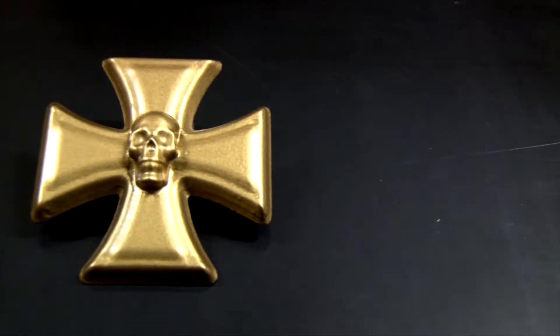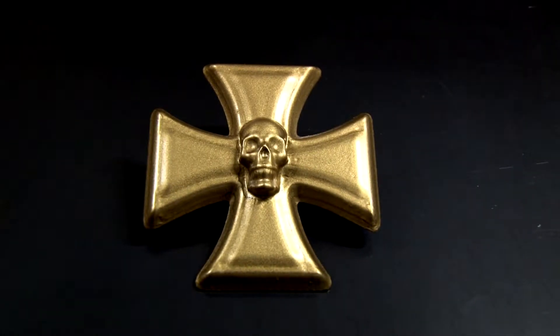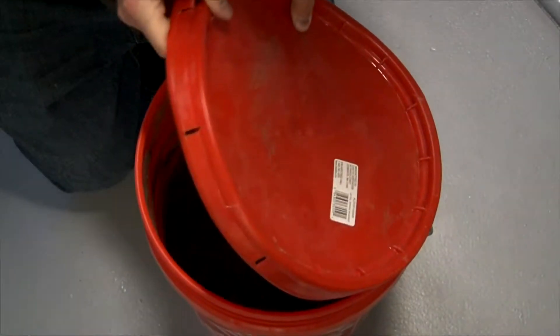This part I'm pretty excited to cast. When I designed it, I specifically designed it for casting. You can see that the eyes and the nose are pretty shallow so the sand doesn't go far up in there and tear out. The sides are beveled so that way it pulls out of the mold real easy.